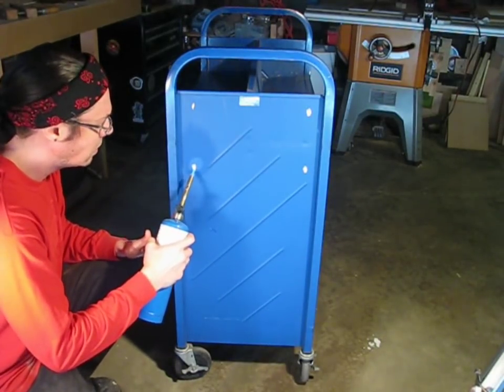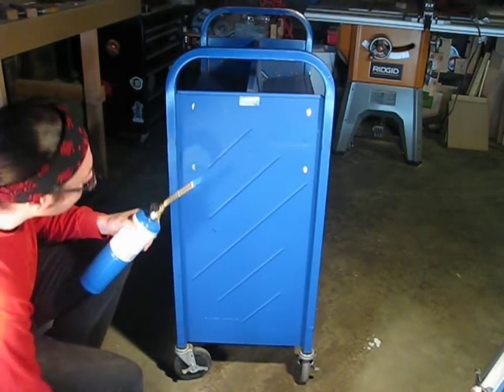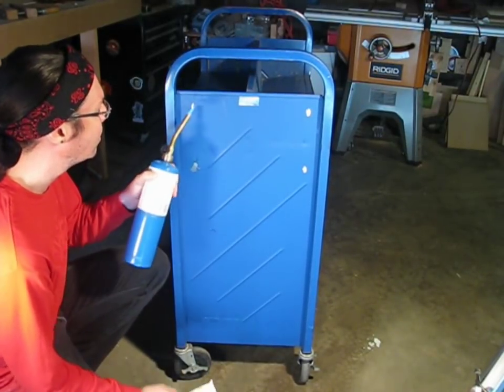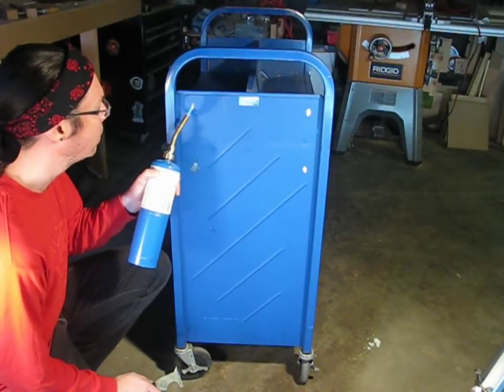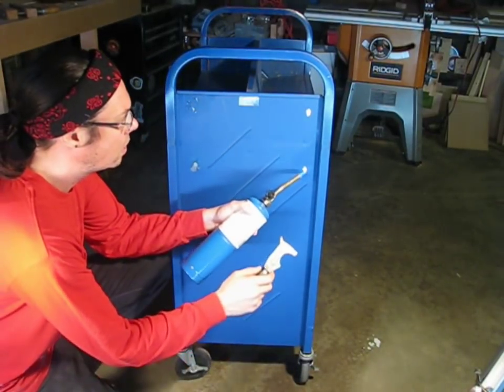Before you even start painting, you need to do some prep work. On metal objects, it's really common to find old tape and stickers and stuff like that. Usually the most efficient way to deal with them is to burn them off with a blowtorch or a heat gun. Try to use a scraper that's a little dull so you won't have to scratch the underlying metal as much.